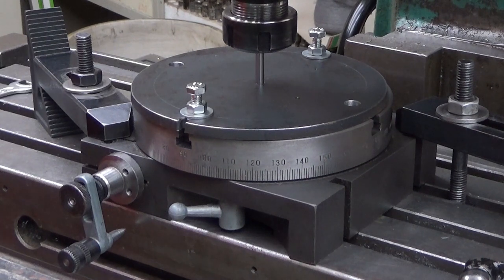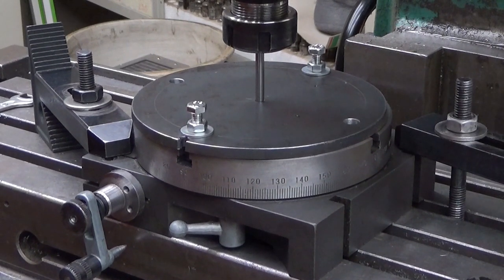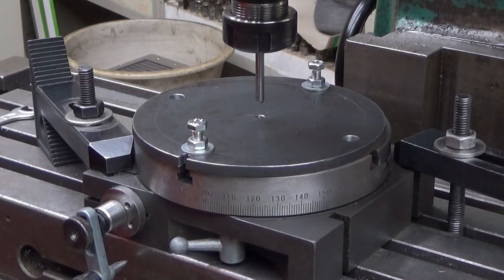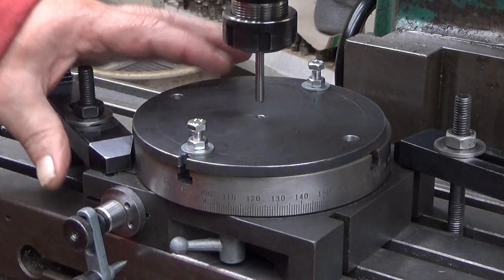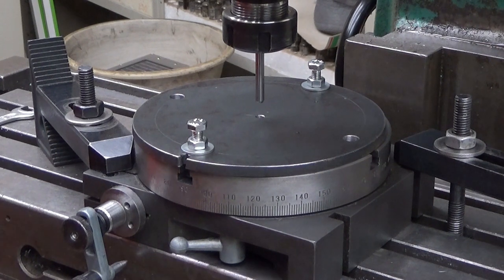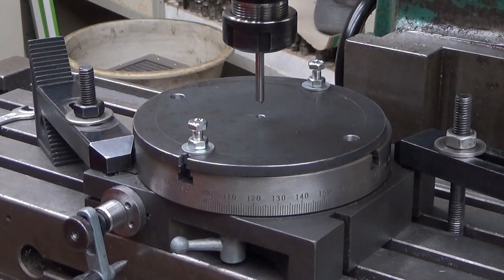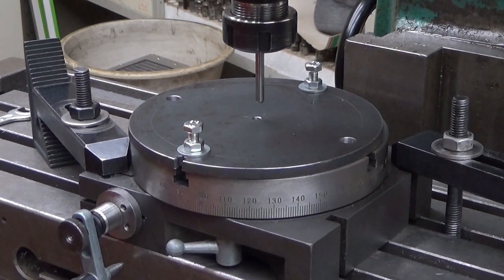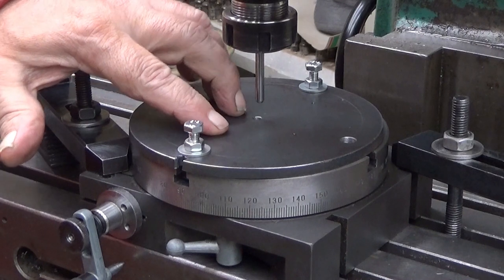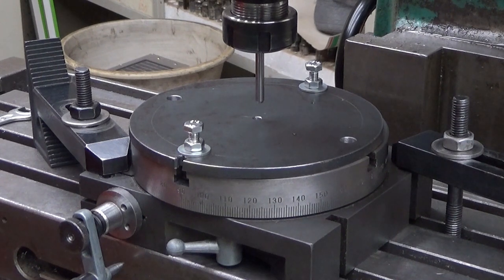Yeah, there you are. And now just pull the pin out from there. Yeah, there you are. And then we are using indirect indexing for all the 8 holes here. And now we need to go back to the zero, this way. Like there. Okay. So now this really is longer, this side. Yeah, okay. Now it should be there.